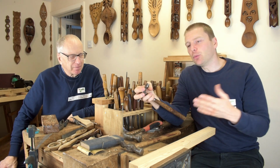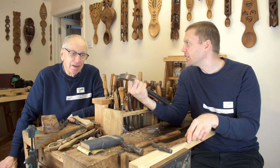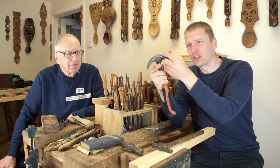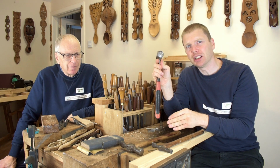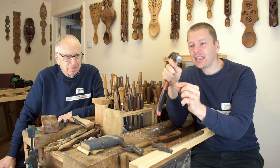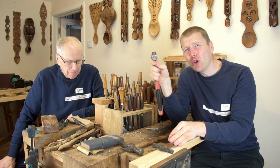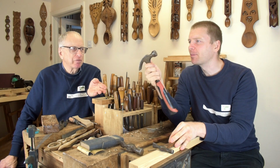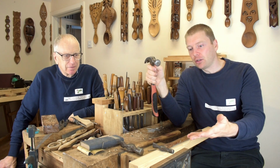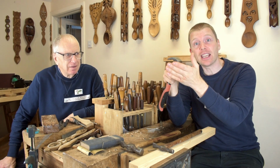And basically, what we're getting at is that hammer in some ways is a little bit dangerous, isn't it? Yeah. Because it's dull, because it's pitted, because it's got a bit of grease on and things like that, because it's not in very good condition, it's more likely to slip and then catch your finger or thumb, which, for anyone who's done it, hurts a lot. And it could even slip off the nail and bruise the wood or the surface that you're nailing. So you can even lose time and have problems with a job because you haven't maintained the hammer.